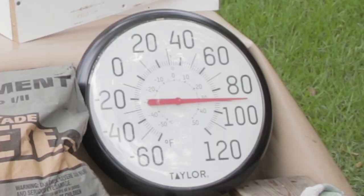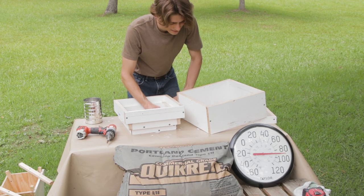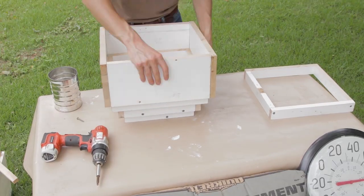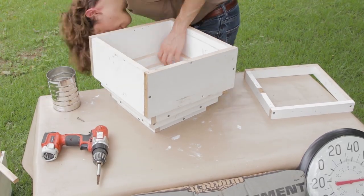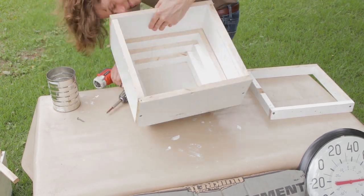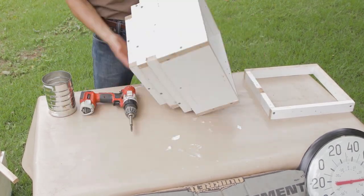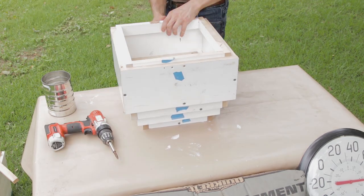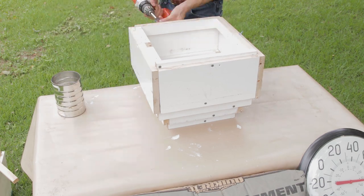Now that we're dying of a heat stroke, it's time to start assembling our mold. As you can see, the mold works by interlocking layers that overlap with one another. This allows each layer to connect to the previous layer, creating our mold. One would find it advantageous to use painted or varnished wood because the concrete will not adhere to it, making it easier to unmold later.